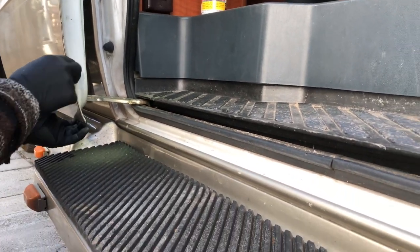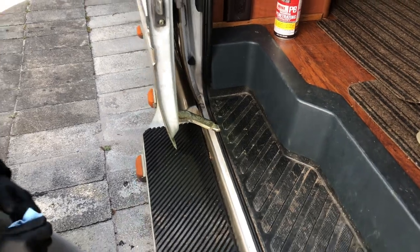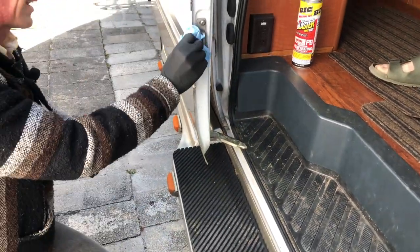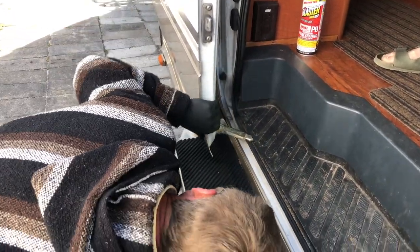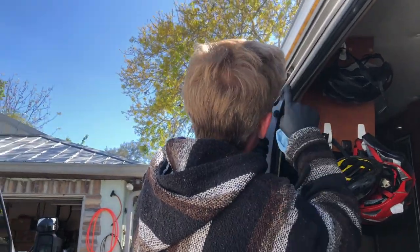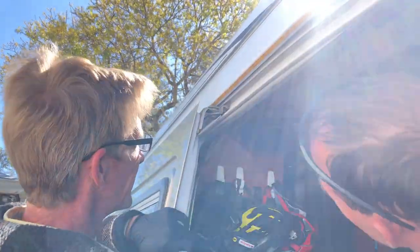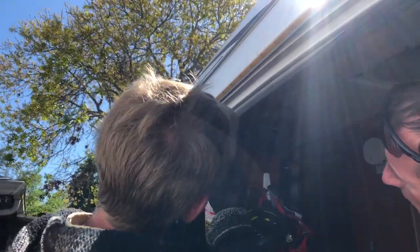I don't see either of those happening. I do have new parts for the door, but it doesn't look like your rollers are bad — just a little misaligned. They're still rolling. These often get flat on one side, and all three of them up there are still rolling like they ought to. They're round and spinning, so we'll keep them spinning.